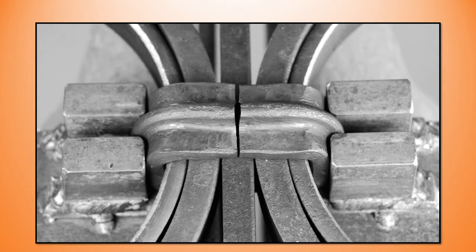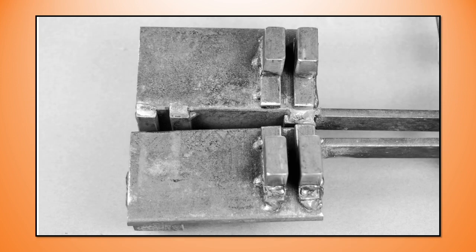I'm going to look at the wrapped collar first. Regardless of the style of bead that you use, thin or wide, you're going to have to make some tooling to protect the bead as you're turning this. And you need to make something that's going to keep the whole thing stable while you're turning in the ends of the collar. Let's have a look at my tooling.